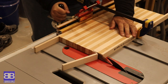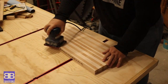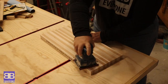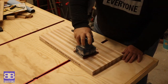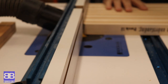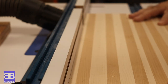Now I simply square off each edge to clean it up and to get the board to its final length. Next I give a good sanding on all edges. I start with 120, then 220, then 320. After 320 I wet the board to pop the grain and after it dries I sand one more time with 320. For this board I went with Team Roundover and I put a slight roundover on all edges. I go back and forth between chamfers and roundovers. I like them both and it really just depends on the mood I'm in when I'm building it.